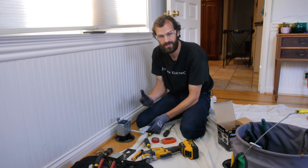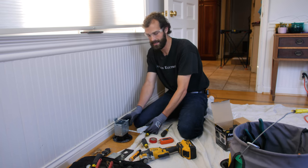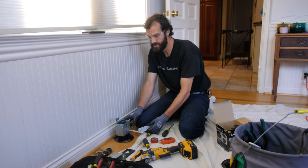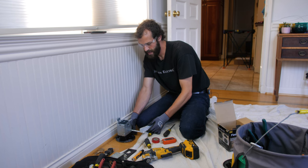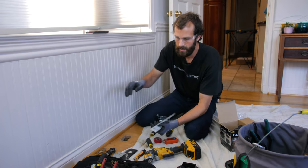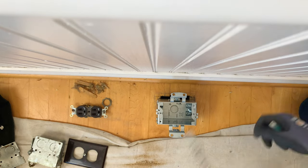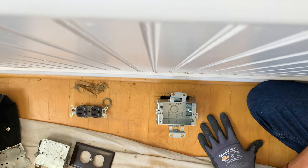The cover is so generous in its coverage of the box that I'm not going to cut this to the nearest 16th. I'm going to give myself a very intentional, almost a quarter of an inch, play on either side. So I'm going to cut this to 2 4 7/8. Those are my cut marks, 2 4 7/8. All right, now I've got a pretty generous cut, and I've got no obstructions to be concerned about underneath the floor.